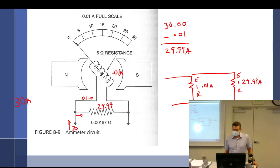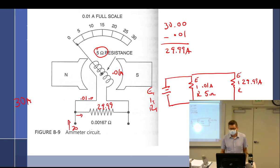Yeah. Okay. But then like any Ohm's law circuit, I'm looking for more information. And of course, I put a battery here just to represent the total that's coming in, because I always do E, I, and R totals. So then I go, well, what information do I have? Well, I have this right here. It's hidden, but it's up there. So that's 5 ohms.